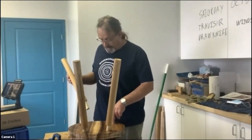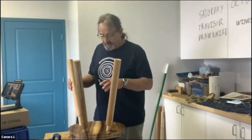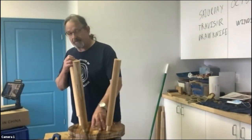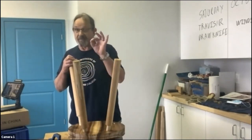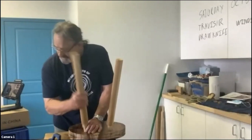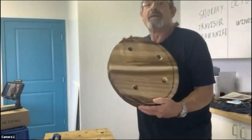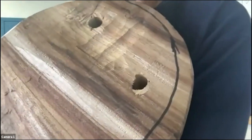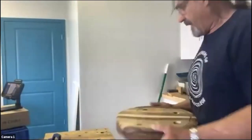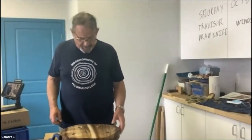What I did was I first plugged it with some poplar, and I'm going to bring this seat down to somewhat close to where I want to be today. Once it's all cut out and I know exactly where it's going to be, I'm going to use those scraps to make little inserts, so hopefully it'll be barely noticeable. Because on the top here, you can see I've got some nice pieces of poplar there, so a lot of that's going to get taken out. Once it's back to where it should be, I'm going to put a little inlay in there — but that'll be another story.